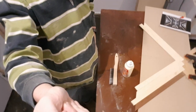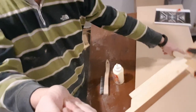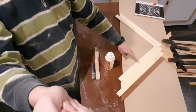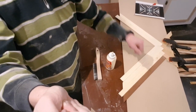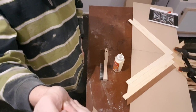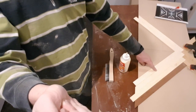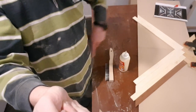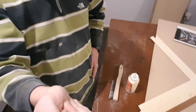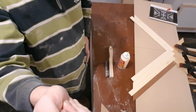We've reached a milestone. I'm starting to get some of the rough cedar down, the pine that's been wire brushed, and now we're putting in our first piece of mahogany. The mahogany is finished, but mahogany is a relatively soft wood, so I'm going to show you another technique to create a little bit of texture. The pine was wire brushed for that weathered look. Now we're going to do something different with the mahogany over at the bandsaw — it's a procedure called blade skipping. It just gives it a little bit of extra texture.